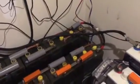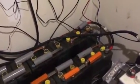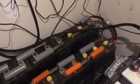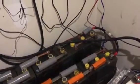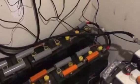of actual use, if you had a lead acid battery bank and followed the manufacturer's recommendation of 20% depth of discharge, to maintain your batteries for longevity, you would actually have to have a battery bank of 2,500 amp hours. So if you take 2,500 and multiply that by 0.20, you get 500. So you get 500 amp hours of actual use.